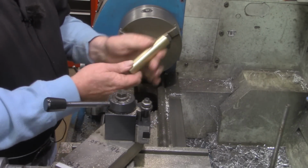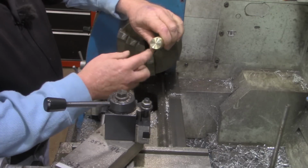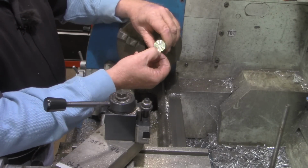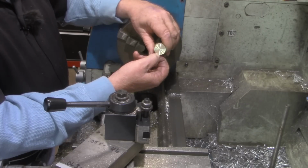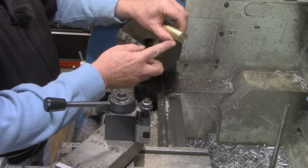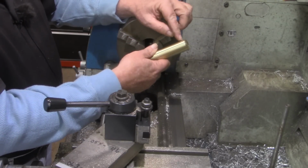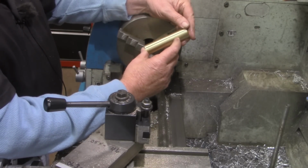Alright, we're going over to the mill now, and what I'm going to do is use the coaxial indicator and get the mill set up directly over the center of this. Then we're going to offset about 2/3 of the radius and drill and tap for probably a 10-24. We'll do all that before we part off what is going to be our cap up here. And once we get that parted and get these two surfaces mated together, we'll work on the rest of getting it to that exact 3.4 length.